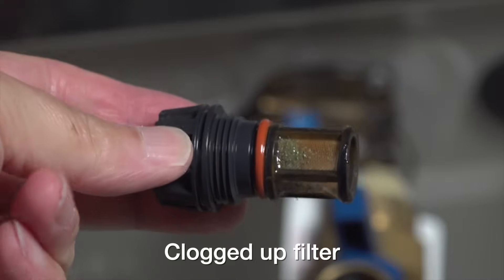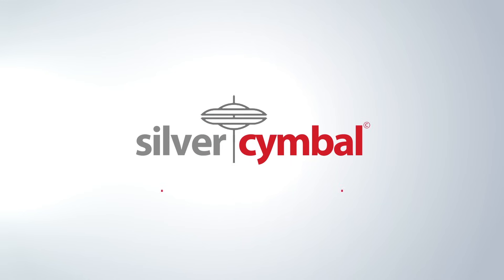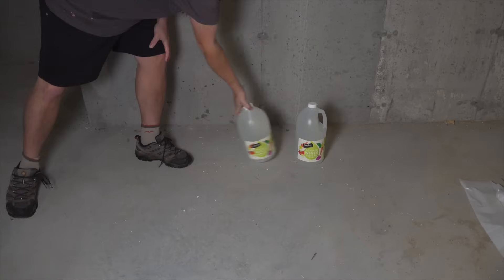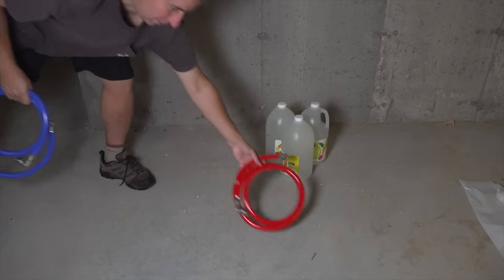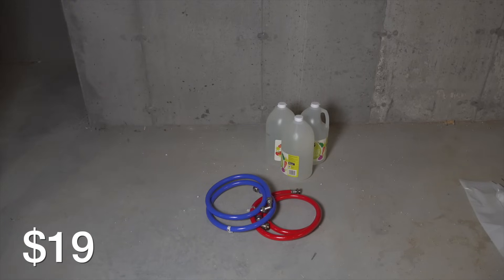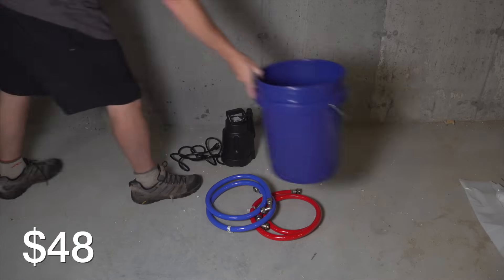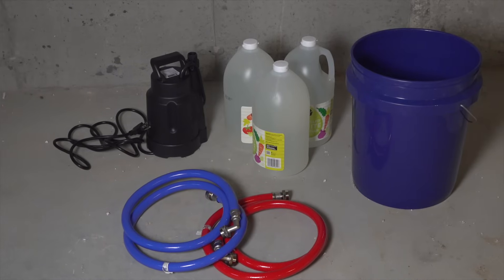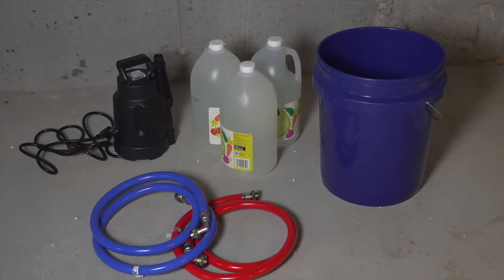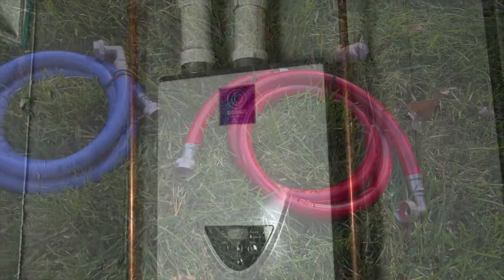So in this video, I'm going to show you that you can do the job yourself. It's easy and it's a lot less expensive. Here's what you'll need: three gallons of regular household vinegar, a couple of hoses — these are just regular washing machine hoses — one of these submersible pumps, and a five-gallon bucket. I've put a complete parts list in the description, and even if you buy all of these things, you'll still spend less than you will to hire a plumber even one time.